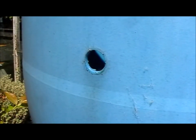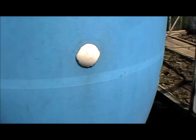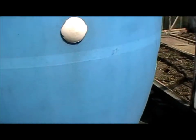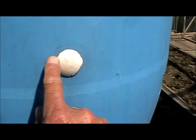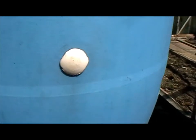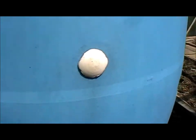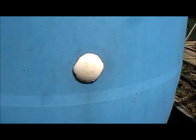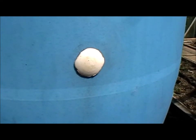I thought I would just show this in case anybody's got the same predicament. I'll come back to you in a moment when I've got this thing in. That was a tight fit - good job I had an old file. I just had to take about half a mil off to get it in. I've also got some gutter sealant here, but I haven't put any on. I'm just going to try it and see if it'll seal without having to put that mastic on. Let's get a hosepipe in and give it a test.